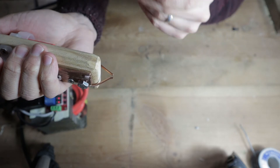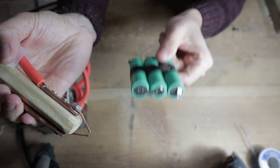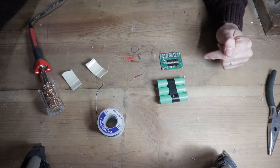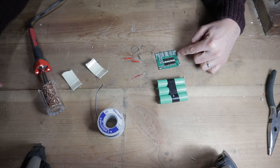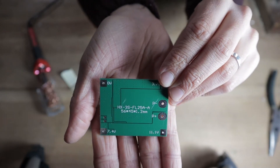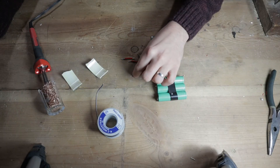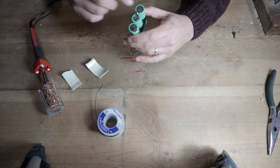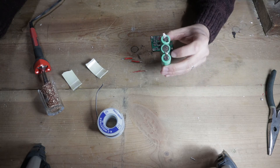Since I have my 3S battery already put together, I'm going to go ahead and wire up the battery management circuit. I have everything set up that I'll need. The one I have here is especially for 3S or 3 Series battery packs — model HX3S FL25A-A. What I've gone ahead and done is pre-tinned my wires and the connection points on the battery, putting a little glob of solder everywhere I'm going to be making my connections.